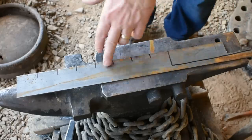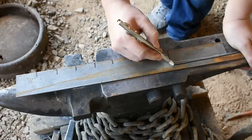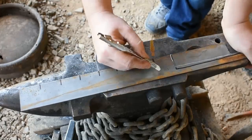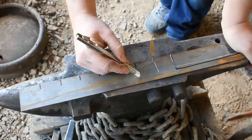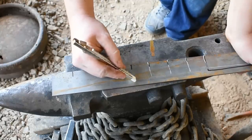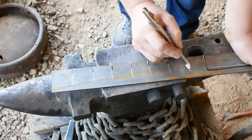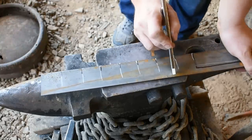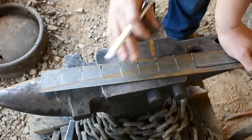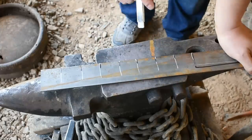As you can see here, I've already got this marked out. We're going to come in and cut here with our metal cutting bandsaw — you could do the same thing with a hacksaw — and we just want to cut what will become the petals for our rose. The thing to keep in mind is to not cut too deep. You don't want too thin an area down here because these petals are going to become fragile as we work them and can potentially break off under the stress of heating up and cooling down.